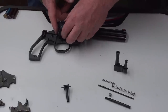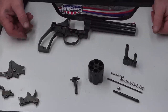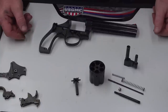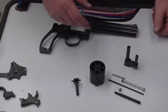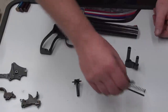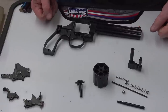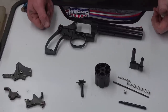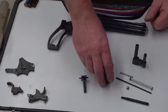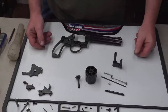Turning the barrel back also requires shortening the ejector rod slightly and cutting the forcing cone. These guns are generally quite durable and will take a good pounding without wearing out anytime soon. The main things that damage them are neglect and misuse: slamming the cylinder open and shut, spinning it cowboy style — all very bad for these guns.